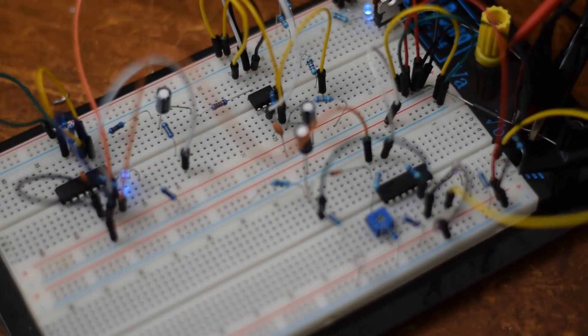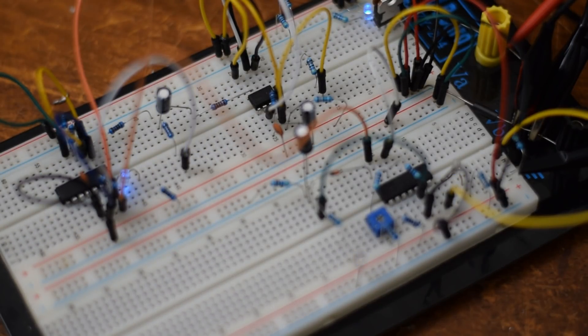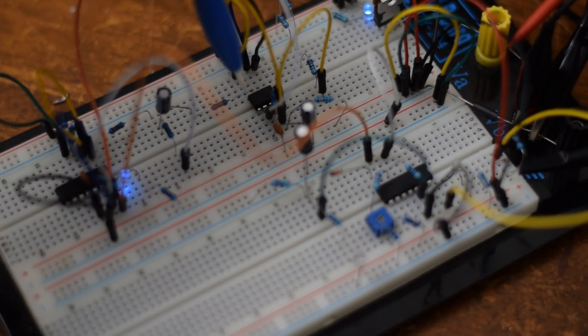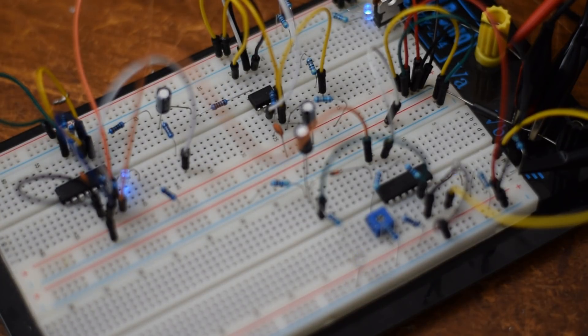It's a little bit hard to predict when I'm going to share my next project, but I still have some pretty good ideas for future directions with this ECG circuit. The output has a connector where I can get the unattenuated signal directly off the chip, and there are several ways this project could go in the future. One of my future goals is to use a circuit to detect heart rate that doesn't involve a computer. To design that circuitry, I found it really convenient to make a circuit that generates synthetic heartbeats, rather than having to hook up ECG electrodes every time I want to practice heartbeat detection. This is a 555 timer in a configuration that produces one square pulse about once a second, running through a combination of resistors and a series capacitor to make it look somewhat like a QRS complex.